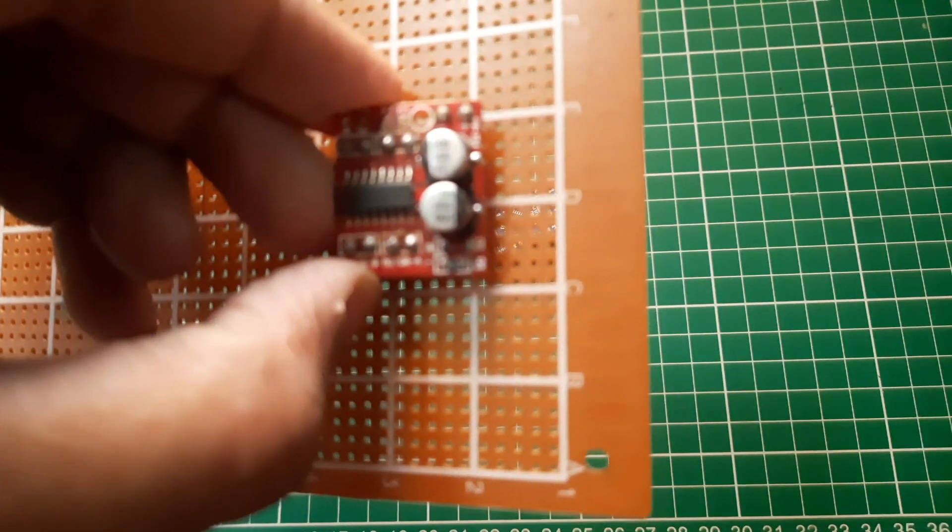For the motor driver I will be using the MX1508, which is a very affordable motor driver. It does come with limitations — it's not breadboard friendly and cannot handle a lot of current — but that's fine since we're only driving N20 motors. For powering the entire system I will be using standard 3-cell LiPo batteries. So let's get started with the assembly.